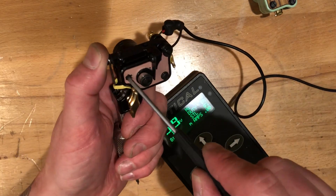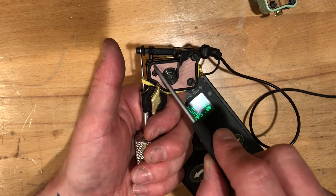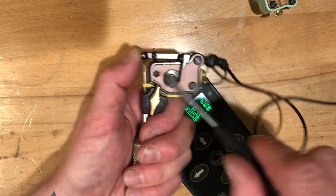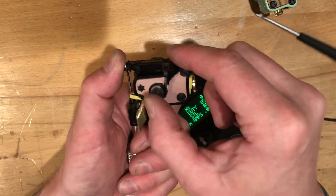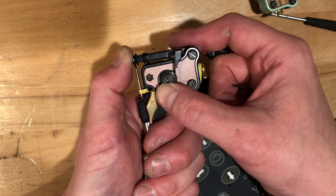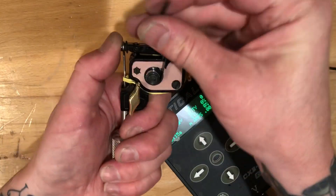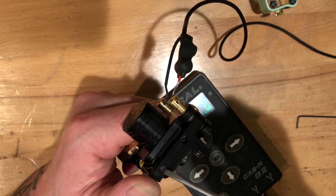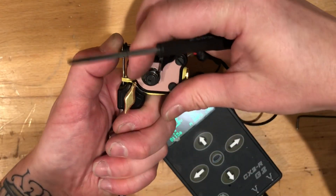For the shorter stroke, it's the marks on the other side. The line on the very bottom is actually the same as the line on the very top. If I want the shortest stroke, at seven o'clock is where the stroke will be shortest, but it's also the most impact. You can see my mark on the cam is way above, so I need to back this screw off. Let's loosen this up and go a full turn first — and I might be right where I need to be.